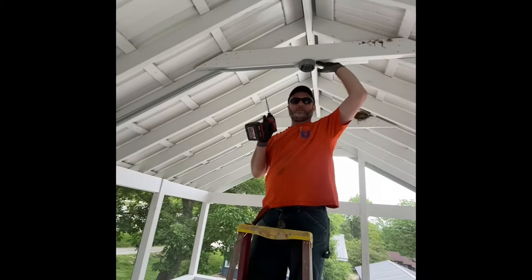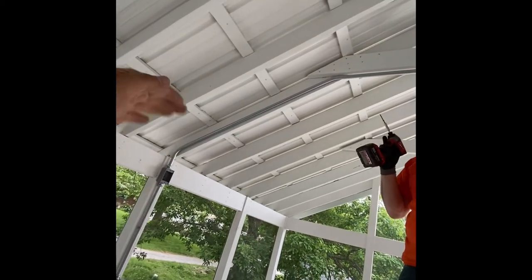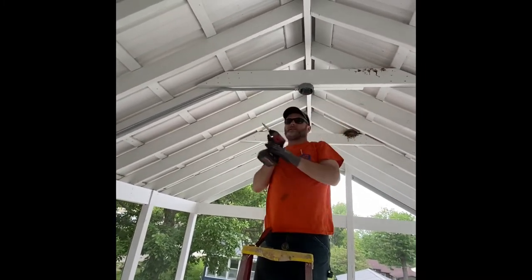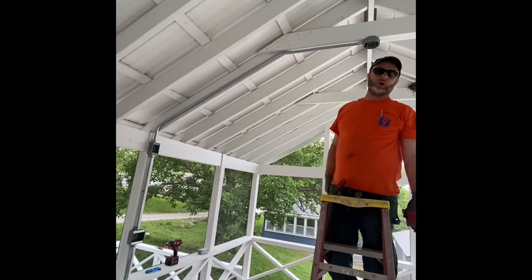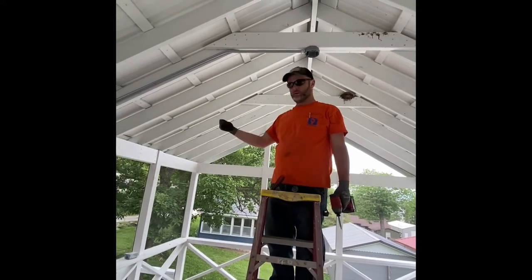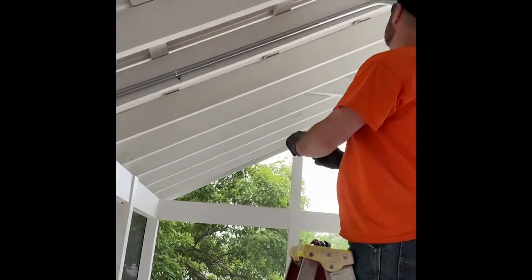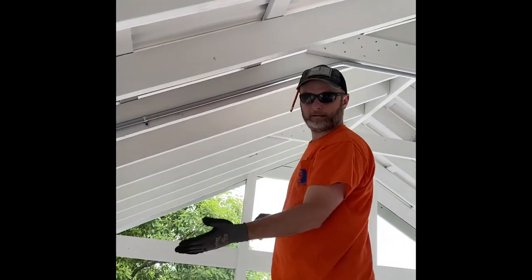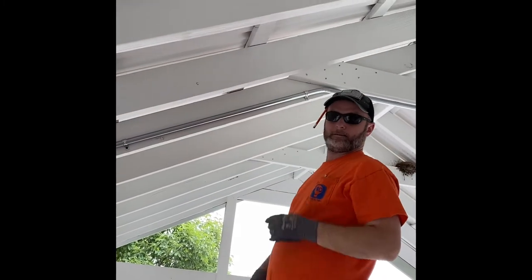The reason we were a little long is because originally the conduit would have fallen more toward the center, so since it came down just a little bit, that lengthened this side. Everything looks nice and clean so we're going to run with it. Code requires within three feet of every box we have to put a strap, so we'll go ahead and do that. As a professional, I like to keep all the straps facing the same direction so it looks cleaner. If you want to get precise, measure three feet from this box — as long as you're within that three feet you're fine. I know this is about 27, so I'm going right past my bend there and I know I'm in code.